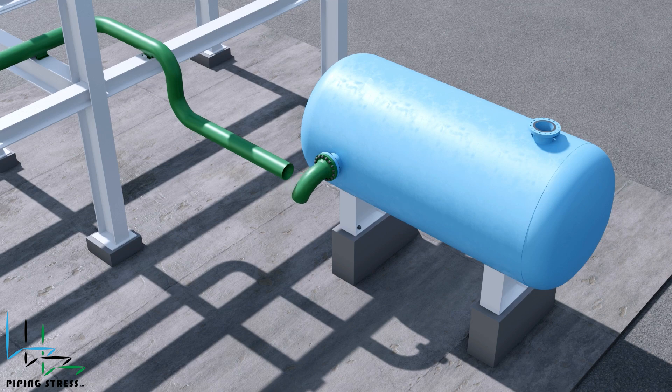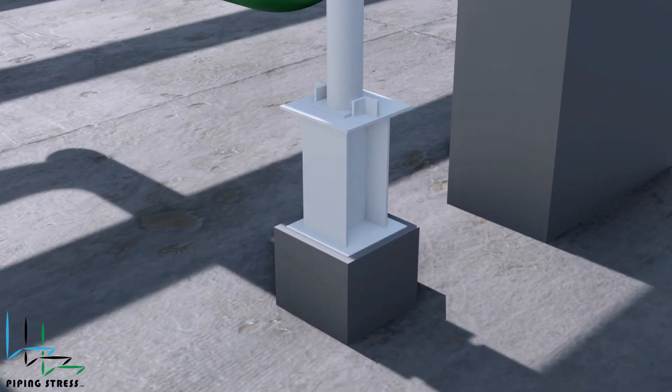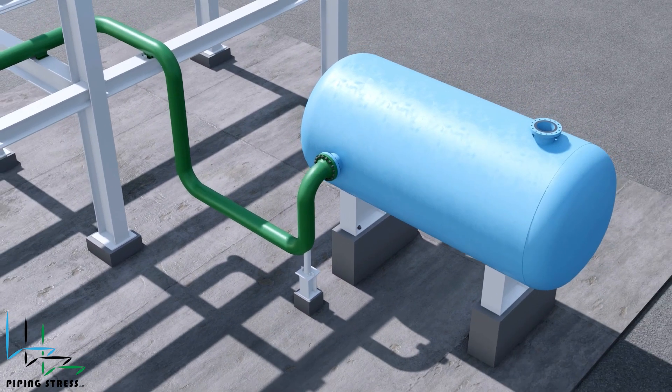In this example, you see a different application of a nozzle that is aligned with the fixed saddle. This type of design allows for a more precise reduction of the high stress that will occur in the nozzle at elevated operating temperatures. The logic here is the same — the aim is to simulate the behaviors of the pipe and the pressure vessel.